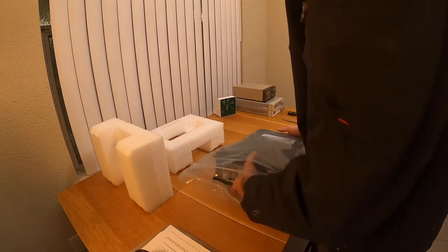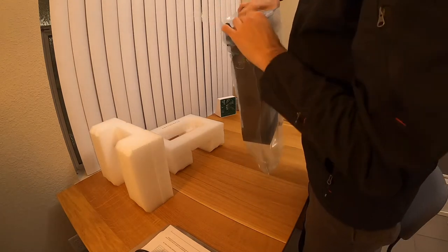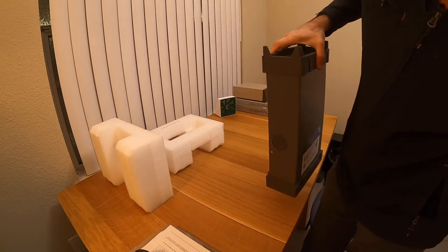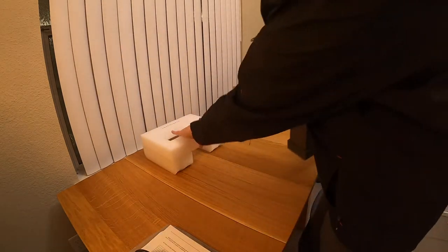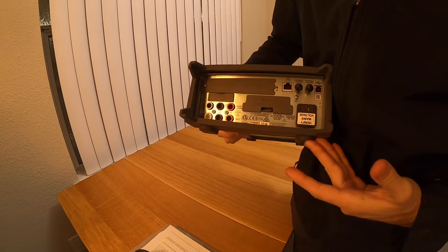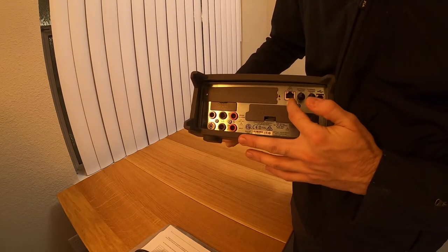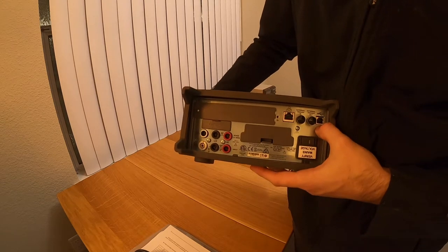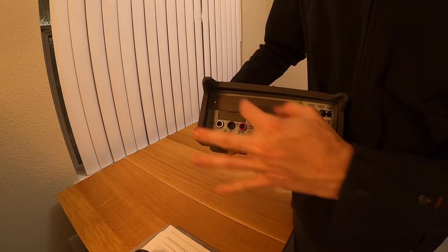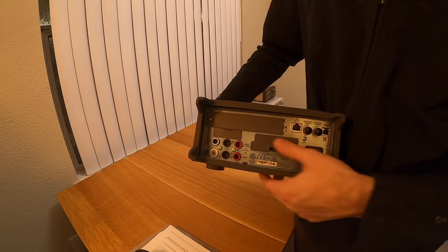Let's look at the unit itself now. I got the standard model — I didn't purchase any options with it. The reason is that even the base unit is quite featured. This is the back of the standard unit. We have the main circuit with the input voltage, which you need to check — that's very important. We have an Ethernet port for communication, a USB port, external trigger in, trigger out. These are the expansion slots — if you get a GPIB interface it goes in there. I believe you can also get a multiplexer card if you want to measure multiple channels at once.